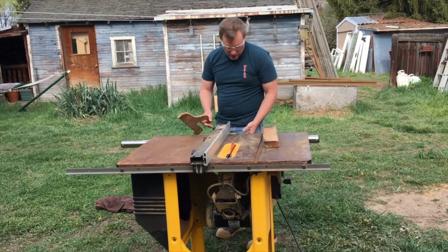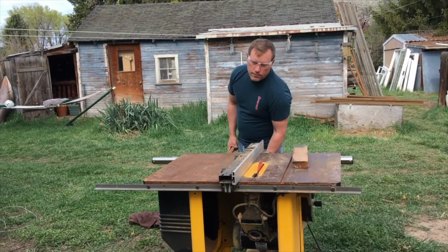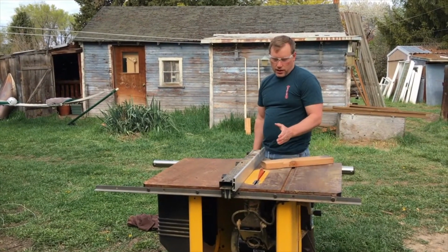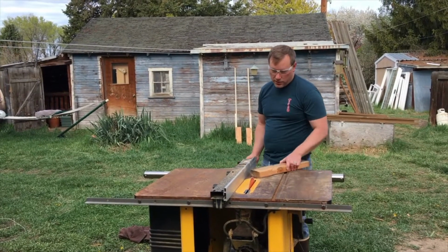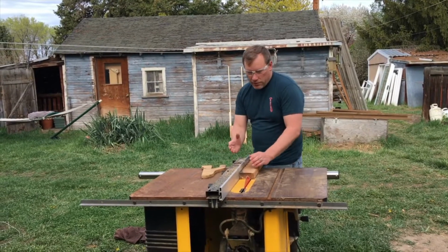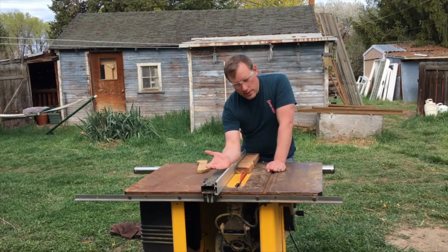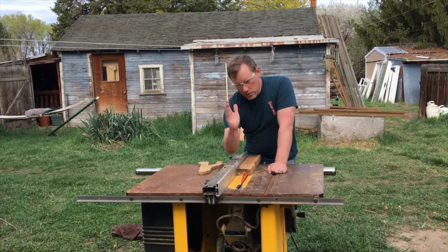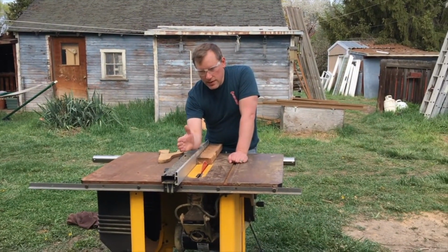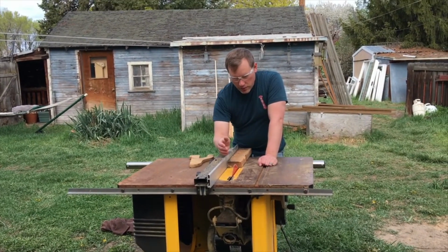And we'll adjust our fence. Often fences will need to be measured again. Make sure that you actually are accurate with your measurements on the fences. This one's actually really good. Another thing that can happen with fences is they could be adjusted so that it goes in and gets narrower. That is not a good thing. Being exactly parallel with the blade is the way to be. Sometimes fences will be adjusted out, and that's not a safety issue, as opposed to one that causes a pinch point by leaning towards the blade.